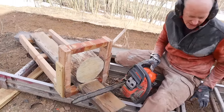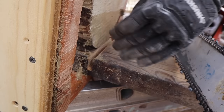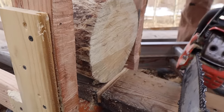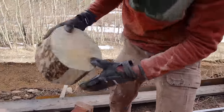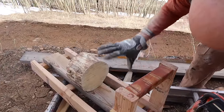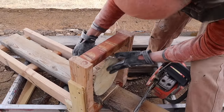I was halfway done by the time I thought of that. You didn't even cut through your board all the way down there — I know, you were so close. So you had to prop up your log? Yeah, and I had to plane it. Because of the irregularities — as I was moving the log forward it would change position. So the planed flat spot makes it square in this direction, and then I drew this line down the middle — that keeps my back straight so that keeps it square in the other direction.